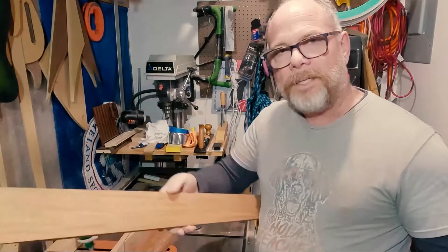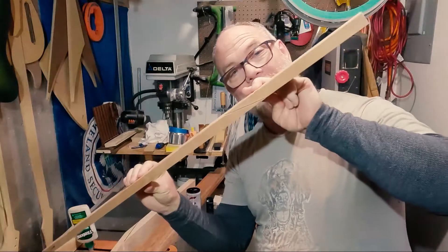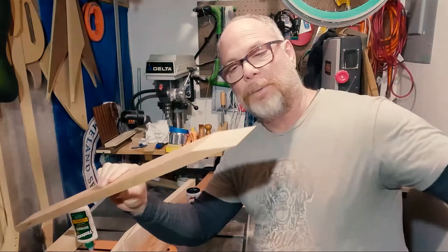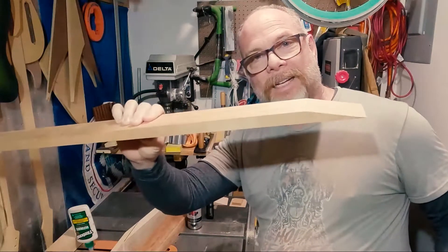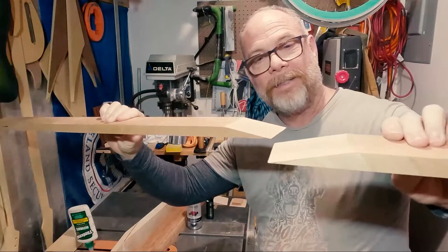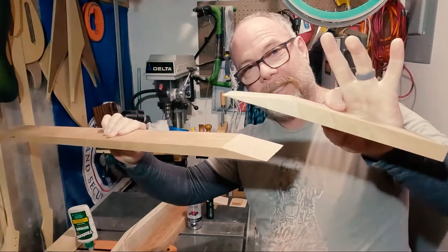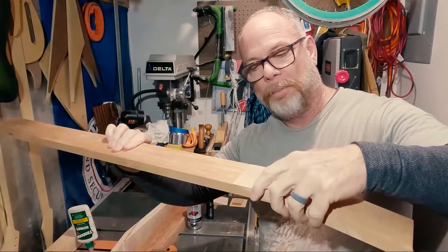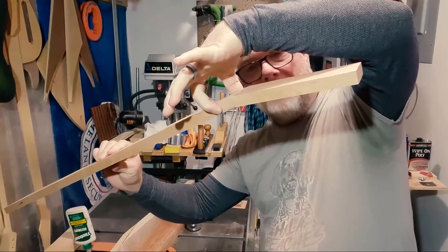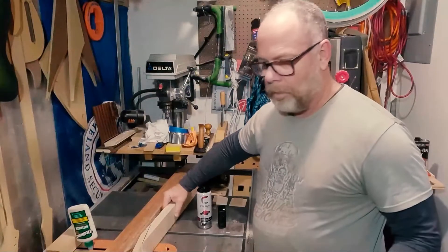So now this piece of wood, which looked like this before, now has the cut in it. This is the neck — the majority of the neck — and then we take the piece that we just cut off, flip it, go boom just like that, and glue it on there. That's how we create that angle of the head at the back.